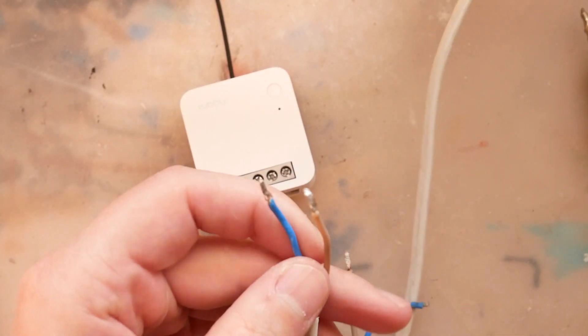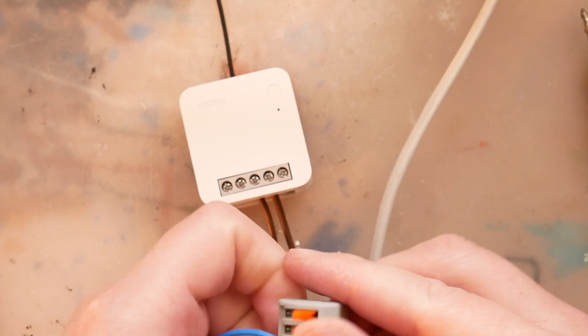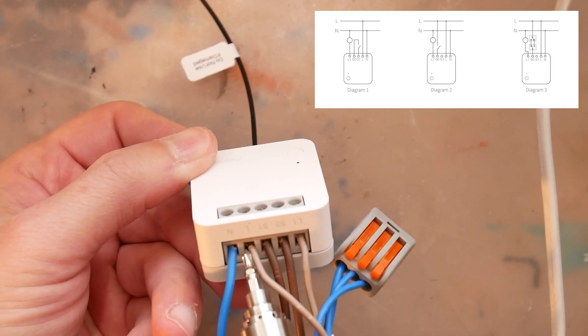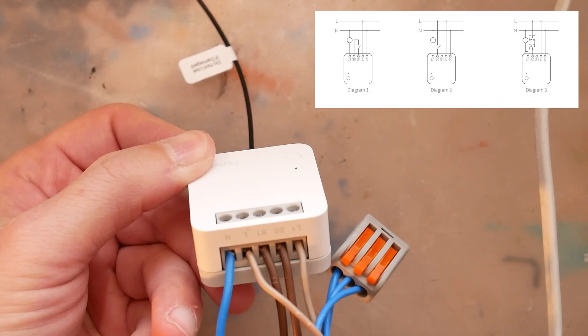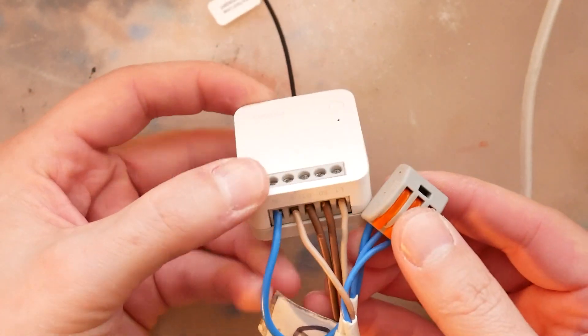Let's get them hooked up and play with the relays. When it comes to the relay with the neutral cable, I have the same complaint I have with Shelly devices — it doesn't have 6 terminals. It comes with 5 terminals, which means you'll have to splice the neutral cable to make it work. Take extra care if you're going to wire these yourself, as you're dealing with mains electricity — if you're not sure, consult a professional. L and N on the terminals is the power coming in. S0 and S1 handle the switch. L1 is the connection going directly to the light bulb, and the neutral must be spliced in.